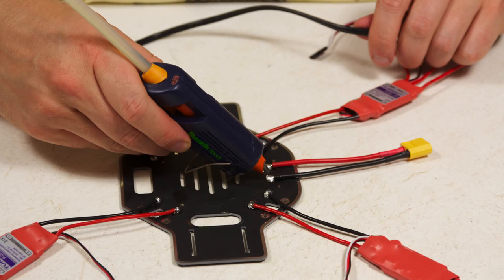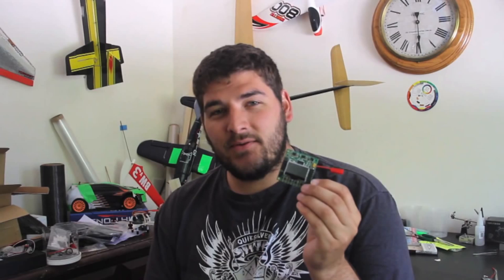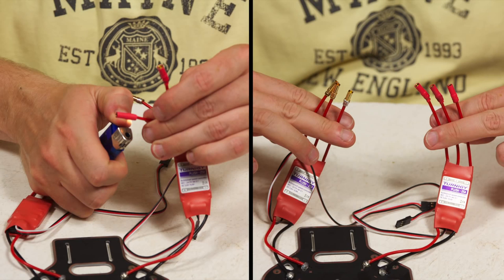Now that you've attached your ESC power leads and battery power leads, you can protect your bare joints with some hot glue — this will prevent a short out if anything conductive gets in there. At this point we forgot to attach the two thin wires that supply the KK board with its power monitoring feature. Fortunately, Don — DHDSRacer as he's known on YouTube — has a fantastic video on how to attach those leads. The link will be in the description box. Please pause this video, go watch that, then come back.